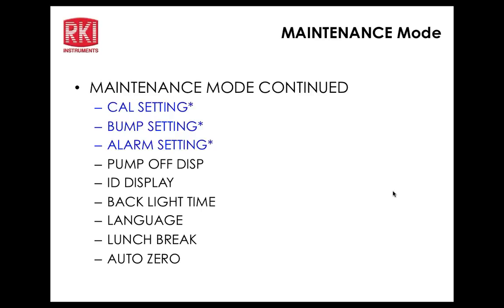All right. And John's asking a question, and John, I think you're right, I think that is the default for the PID sensor, that the zero suppression is 0. Yeah, it has a very low detectable level. So you can set the PID to 0. Yes, you can set any of them to 0. If you do that, you may see a little bit of fluctuation. Sure, the humidity changes. But anyway.